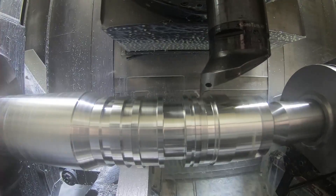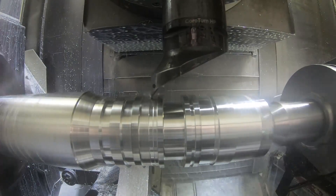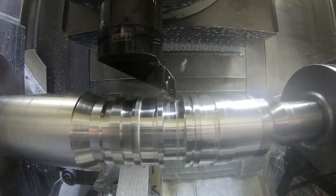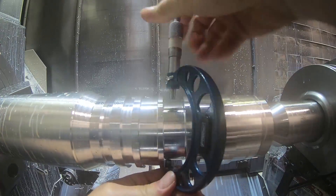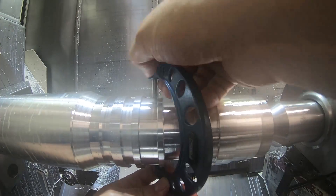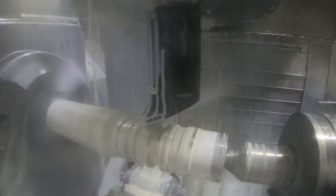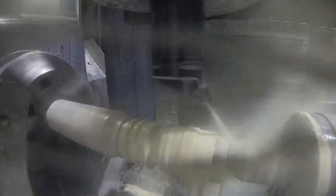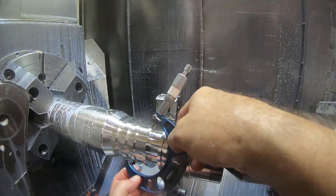I'm going to use a separate roughing tool on the grooving from the finish tool because of the Inconel material — it puts less load on the finishing tool. Here's the finish OD tool, a VBMT insert with 30-thousandths tip radius, finishing those grooves. Then rotating the tool 180 degrees and turning back the other direction. You have to be careful to match the offsets — I measure it once here and then rerun the tool and adjust the offsets so they both match. The shallower grooves here have a two-thousandths tolerance on the OD, and it also finishes that deeper groove as well.